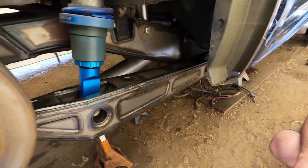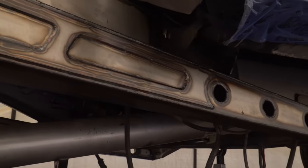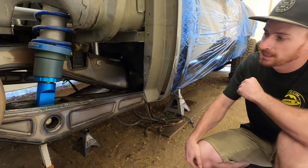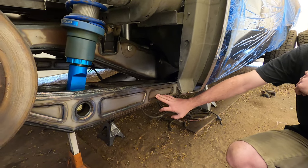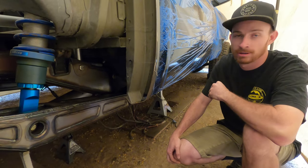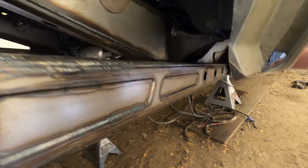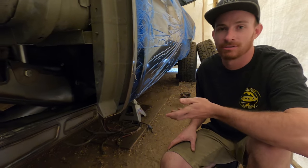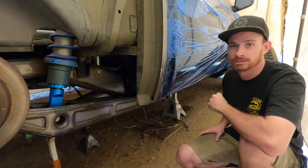So this is a 55-inch lower. This trailing arm is 100% designed by myself, and my brother helped me get the final rendition all set up. This was all cut and made here at our house, which is kind of crazy to think we're able to do this out of a garage. It's all 4130 plate — that's what Aaron wanted. I probably won't do 4130 plate again for anybody else unless they specifically request it, just because it adds a lot of cost. But these should never have an issue. All the lower link pivots were also designed and cut here. I'm trying to make everything myself so I can start putting my own product on the vehicles I'm working on instead of using other people's stuff.